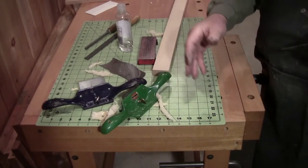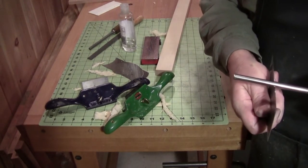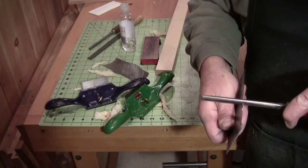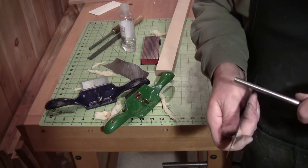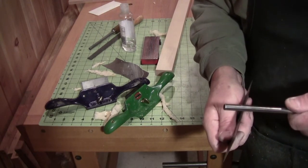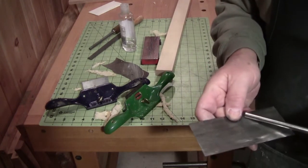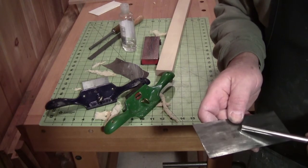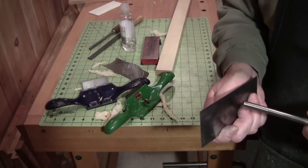Next comes turning the burr. Turning the burr means you want to move the burnisher 5 degrees, 7 degrees, 15 degrees, some angle, okay? And the more severe, the harder you're going to turn the burr. Now, this is a Sandvik scraper, and it is extremely hard. I have a hard time pulling a decent burr on this, but it's what I use.